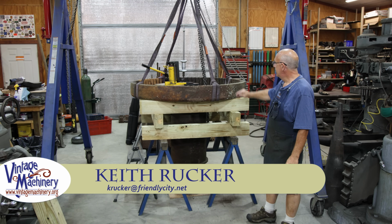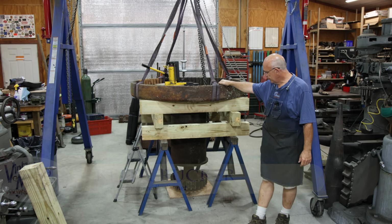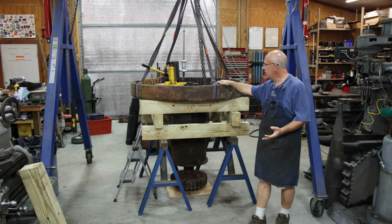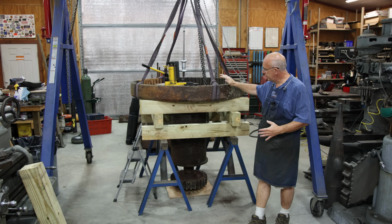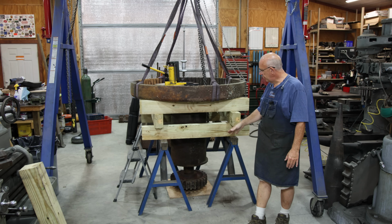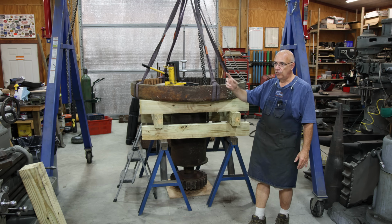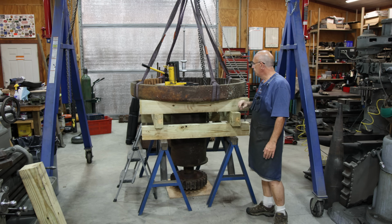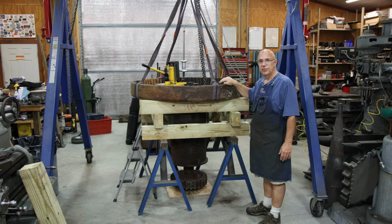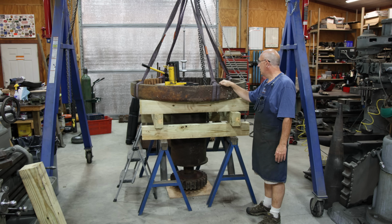Guys, so today back to work over here on this big monster cane mill project, and we kind of left off last time. We had started the process of trying to get this large gear off of the main roller so that I can get that roller over on the lathe and do some turning to the journals and get those ready to pour new babbitt on. It, of course, was giving us trouble, as one might expect.